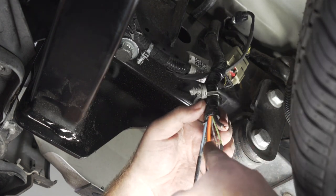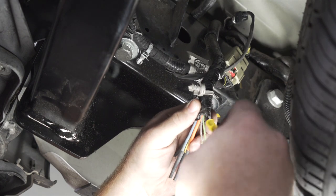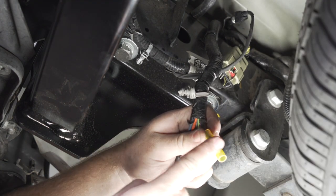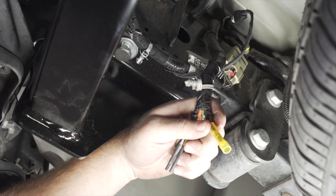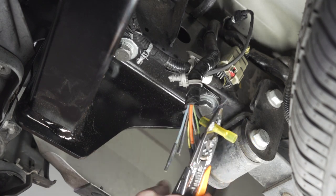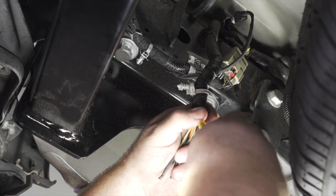We don't want all of them just hanging around with loose wires because if they touch each other they may short out. So as we strip each one, we're going to take a heat shrink butt connector — we have two different sizes. We have a yellow butt connector for our larger gauge wires and a blue one for our smaller one, as that will have a better connection for us. Then we'll go ahead and crimp it down, and we're going to repeat that on all of our wires.